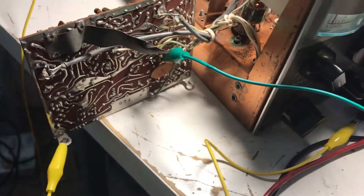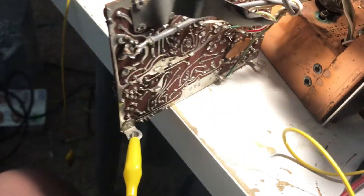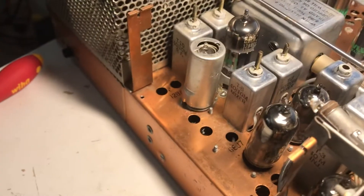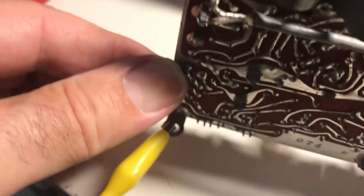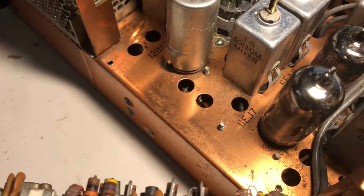Time to put this thing back in the radio. The only problem with the way this was done — I like to put the radio as tidy and efficient as I can. They had the tube cover off of there, and I didn't like that too much. I bent these resistors around to go away from that, and I'll install this backed out a bit, tightening the screw with that little lug backed out so when we hit the cover it clears. I probably should put some tape or insulation in there just in case. Okay, that's it for this Drake TR4 — it's going back together and we'll test it out. Thanks for watching, have a great day.